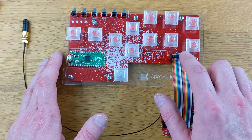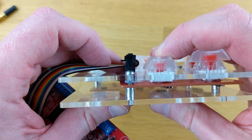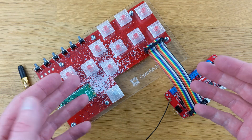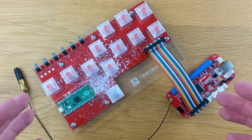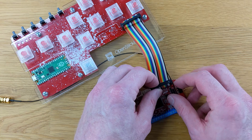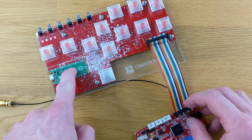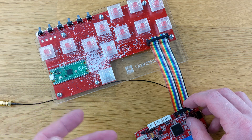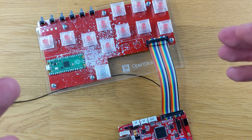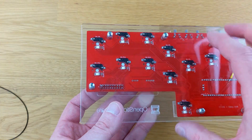The first issue is with the connector — it gets in the way of my button presses because it is raised up quite a bit. You can see when I press the buttons down, it's actually sitting above the buttons. The second thing is my palm hits this cable as well as the Brook board. While it is cool that it plugs into a Brook board and works very well, it's not a very practical or feasible setup. On top of that, I made a huge mistake — I wasn't paying attention when I plugged this in, I had the Brook board flipped around the other way, and this resulted in a short. The Pico immediately started heating up, I smelled burning, and I thought I fried the device. Thankfully I didn't. This was mainly user error, but it would have been nice to see a connector designed in a way that I couldn't make this mistake. From my understanding, they will be moving this to the bottom of the board for future iterations, which is awesome.